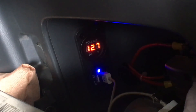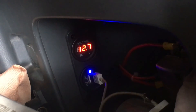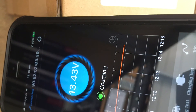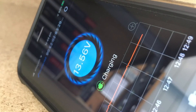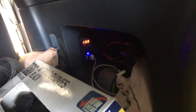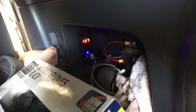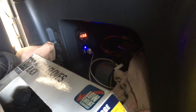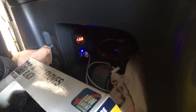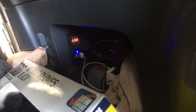Let's go back around to confirm at the back of the vehicle — so you know it's not just the regulator at the front. 12.7. So from what we saw earlier it is charging, but not exciting. Just after midday now — say 12:30 to 1 o'clock. Melbourne, sun's on an angle, it's winter, but we've got a fair bit of sun — pretty well full sun. Here in the vehicle with the dodgy regulator we're finally seeing around 13.6 to 13.7, and the other one is consistently sitting on 13.7.